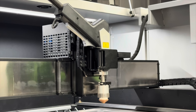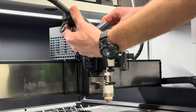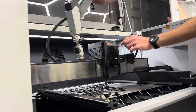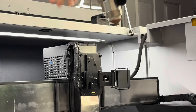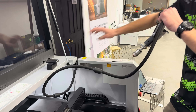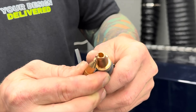To switch over to the welding function, thankfully it is all tool-free. You just remove the laser head from the CNC with a latch, attach the welding head — there are two connections that line up — and it's just as simple as that. Then replace the cutting nozzle with the welding nozzle and attach the wire feed cable.